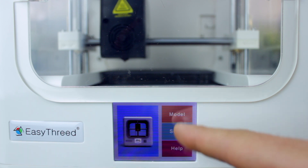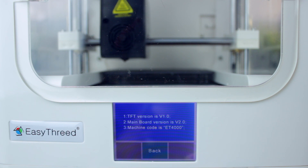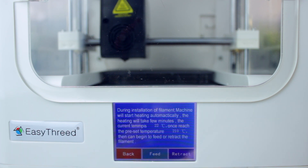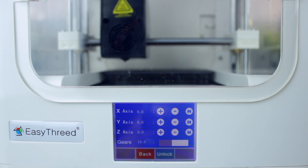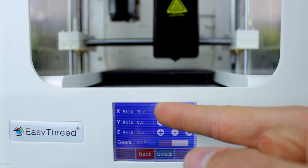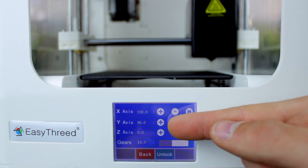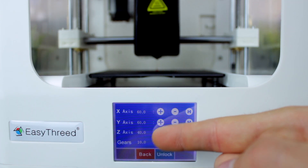If we touch the screen again it will bring us back to the main menu. Now I'm gonna press the Setup button. In About, we can see the firmware version. Next, in Feed Retract, we'll be able to load and unload the filament — once we enter this menu, the nozzle will start heating up until it reaches the target temperature of 210 degrees Celsius. We can then press the Feed or Retract buttons to load and unload the filament. Now I'm gonna enter the Handset menu, where we'll be able to home or control independently each of the axes of the printer. You can move it, for example, 10x10mm manually, or press the homing button to go to zero. We can move the X, Y, and Z axes to a maximum of 120mm.